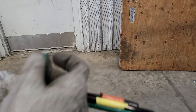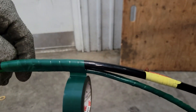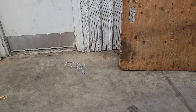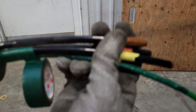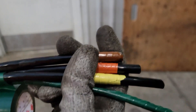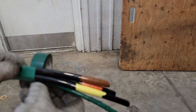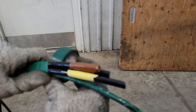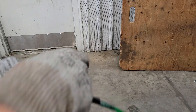Now I'm going to add my last wire. You can do this with as many wires as you have — just put one, add a little tape, put one, add a little tape. This one we're going to stagger back a little farther. Keep them nice and tight together. This is the last wire I've got to add, so essentially what that's done is put one continuous piece of tape from beginning to end through this pulling head, so the likelihood of this slipping is very low.